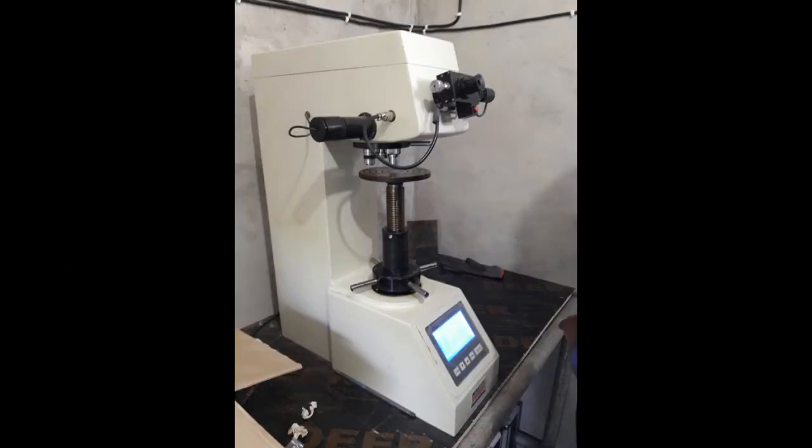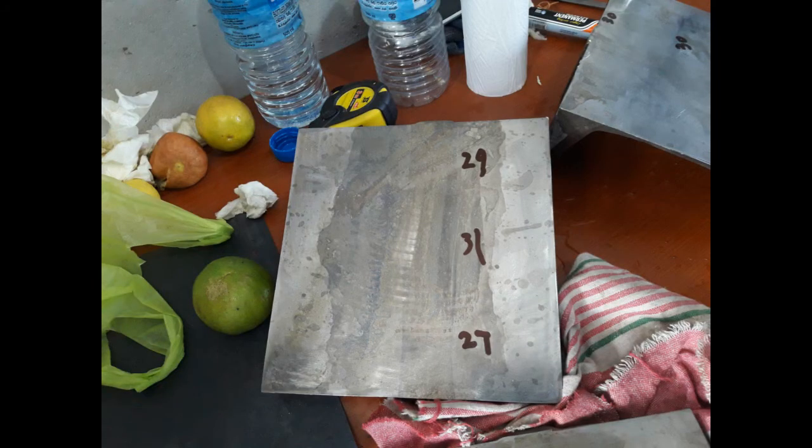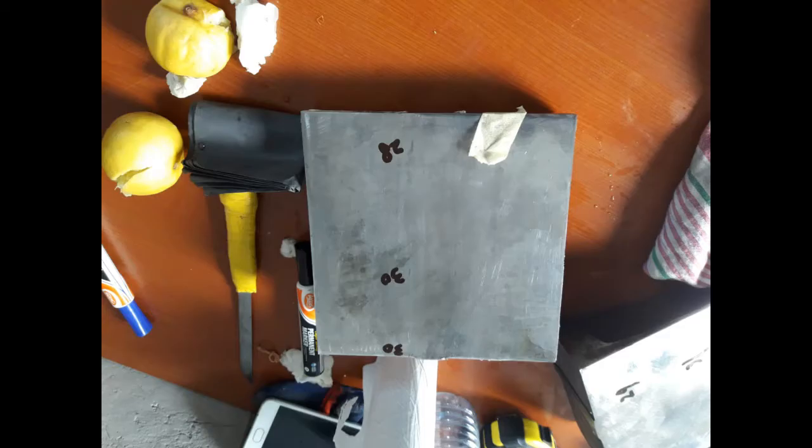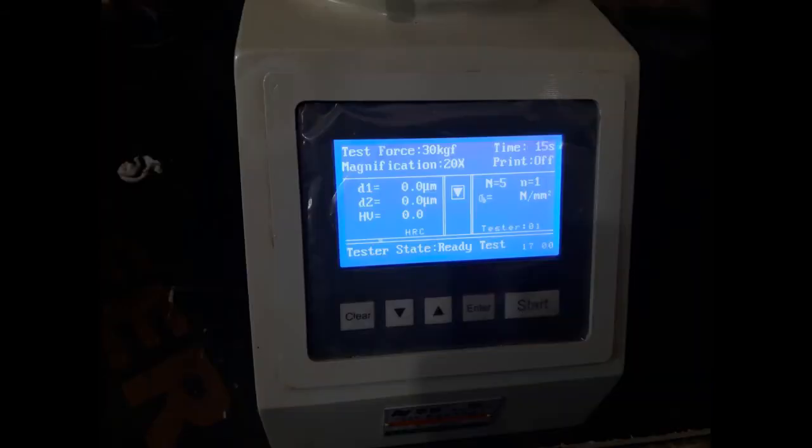The variation in hardness across the heat-affected zone of each of the two welds shall be measured using the Vickers Hardness Test HV30. Impressions to be on a line between 3 mm and 5 mm below the running surface on the vertical longitudinal axis of the rail. Spacing shall be at 2 mm centers. The hardness traverse should extend into the unaffected parent rail no less than 20 mm.